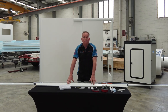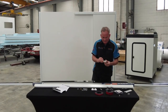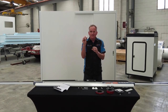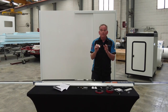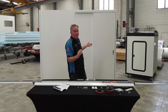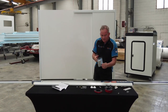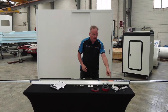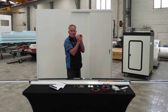Let's talk about why we discard the plastic guide. The guide that comes in the kit is designed for doors with a bottom groove. Because our door is capped in aluminium, we don't do that, so instead you get this aluminium sliding kit which is designed for doors without a bottom groove. That aluminium kit cups the door on both sides.